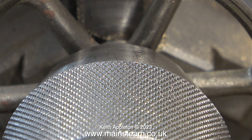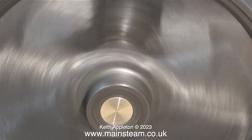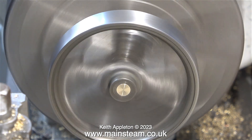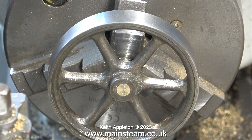In this next clip you will clearly see what the problem is. With the flywheel pushed firmly onto the mandrel, I spin it in the lathe — just look how off-center this center boss is. The good news is the outer diameter of the flywheel is spinning true. All I really need to do is machine the bosses at both sides, and that will take place in the next episode of this series.